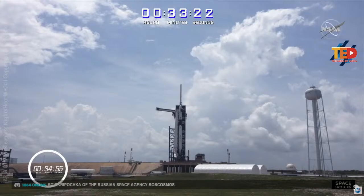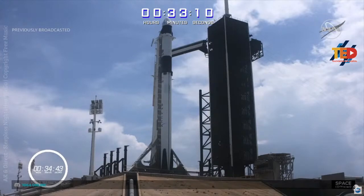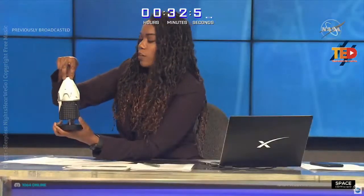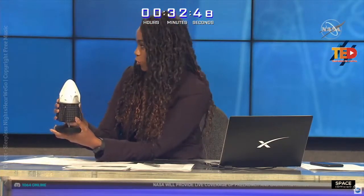And as you just heard, propellant load has started on Falcon 9, and that's awesome. All right, so that bipropellant system feeds all of the engines on Dragon. So Dragon has 12 service section engines, so there's 3 in each quad, 3, 3, 3, and 3. Those are used for on-orbit maneuvering for Dragon. There's also 4 additional Dracos that are underneath the nose cone for large Delta V maneuvers that the vehicle will perform. But the engines that Nick Pizzone was talking about earlier are Super Draco engines.